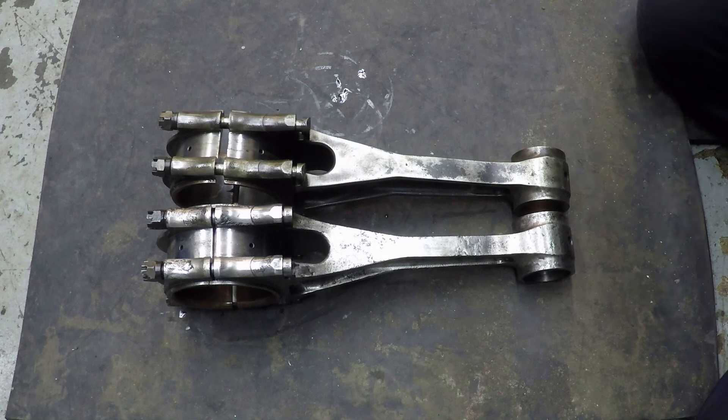Supercharger-wise, the engine started off at 6.25 PSI above atmospheric pressure on the very early engines. They introduced 100 octane fuel in 1941, which enabled them to push the boost up to 12 PSI. When they made 2,000 horsepower they were doing that at 25 PSI. They also had engines on test beds making 30 and 36 PSI, producing up to about 2,650 horsepower, but these were never used in aircraft. The next episode will look at assembling the lower crankcase or sump, and all the oil pumps.